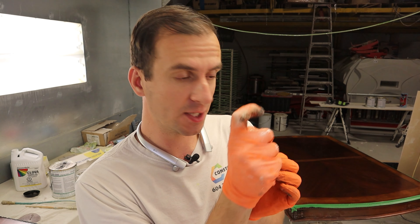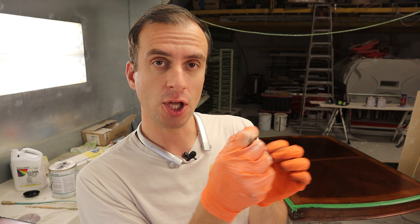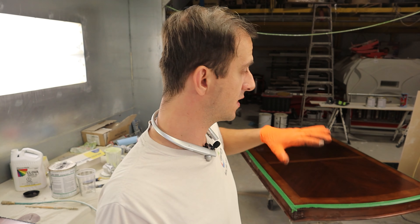I got some deep scratches on my tabletop. If your scratch got deeper than the clear coat and it actually touched the stain, it changed the color of the wood, then it gets really difficult to fix it up without stripping everything down. So I'm going to go ahead and strip everything down first, then give it a light sand to get rid of the stain, whatever is left on the surface, and then reapply my stain — and basically it's going to turn out as a brand new tabletop.